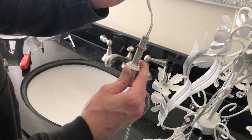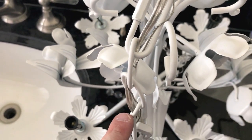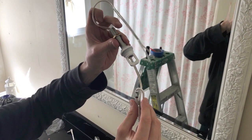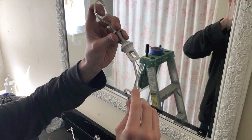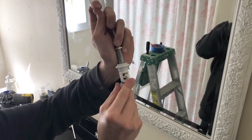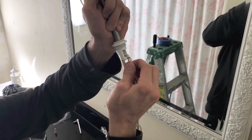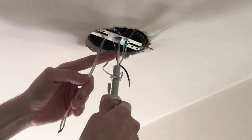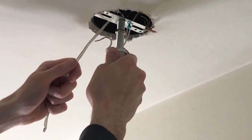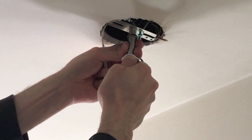Took the back off the ground wire and fit it through the entire chain length. Next, before we actually hoist this chandelier up and secure it to the mounting plate, we don't want it hanging from the wire — grab the actual chain and secure it on this loop and lock it into place. Then feed the wires through the actual hole of the mounting plate and slowly rest this bolt into the hole and screw it tight. Tighten this bolt far up into the mount where you can see the bolt on the upper side.